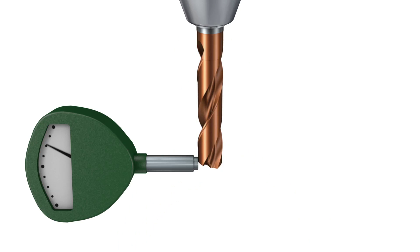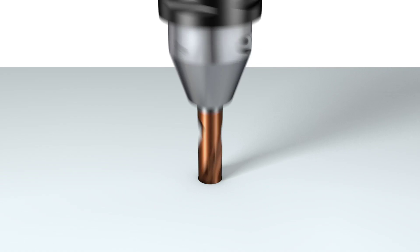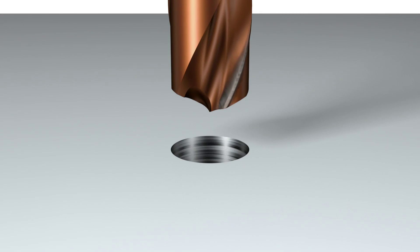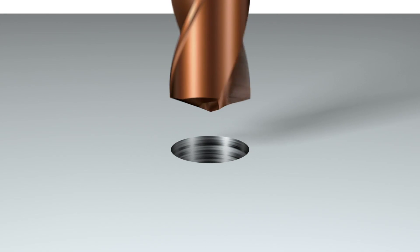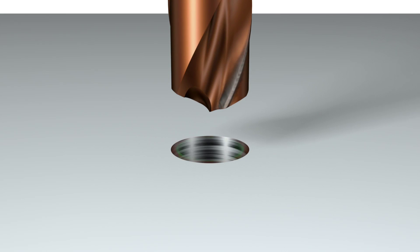The tool life of cutting tools is in most cases directly related to the level of runout of cutting edges in relation to the center line of rotation. Runout has a big influence on tool life and also greatly impacts component quality. High runout will lead to uneven margin wear, oversized holes, and bad hole quality through bad surface finish and burrs.